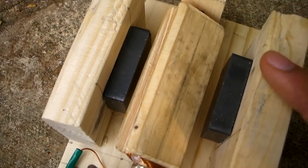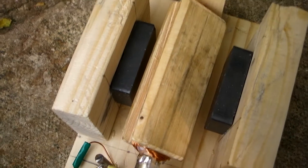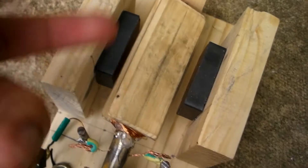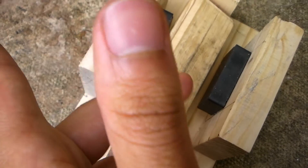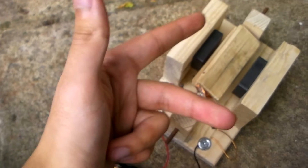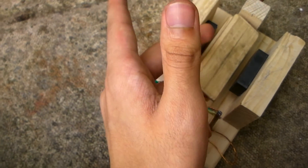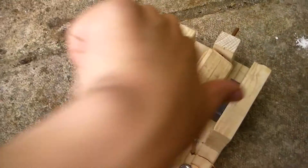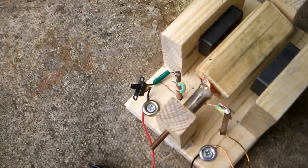There is the coil, and the magnetic field lines go from north to south. So when current's flowing in this direction — in other words, you're going through this part of the coil here — you should experience a force going upwards. Fleming's left-hand rule gives a force going upwards, and you should experience a force going downwards when it's coming back to ground. So I'm going to start it up.